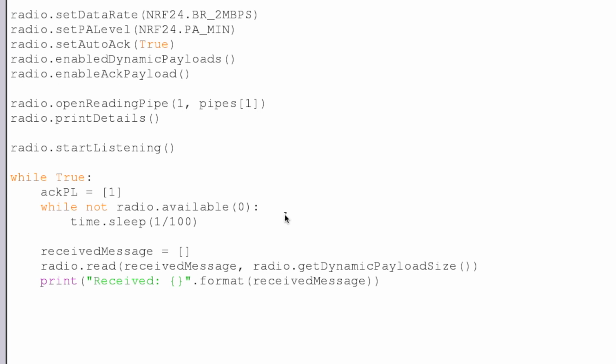The way that this communicates is in bytes, like 8 bits to a byte. And so what that means is the only thing you can actually send through the radio is an integer value between 0 and 255. It's the same as 2 to the 8. You have 256 values that you can send. So you can't really send the letter A. You can send the Unicode encoding for the letter A, which is represented by a number.